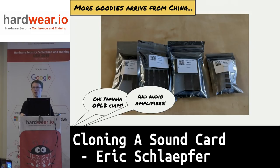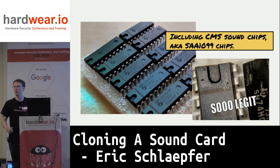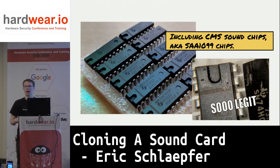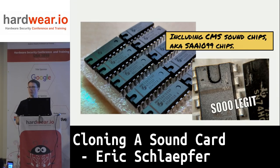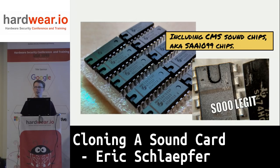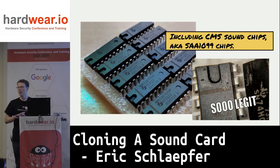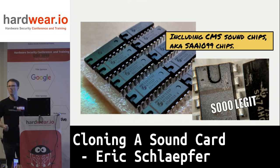Now that I have code, I can start ordering stuff from China, including some of the synthesizer chips — the SAA1099s — that the Sound Blaster uses to maintain compatibility with the Game Blaster. These chips are actually fake. You can see comparing them with 74-Series logic: if you scratch a real chip with a knife it turns white because of glass fibers in the packaging. When you try that on a fake chip that's had its part number scraped off and replaced with paint that's been laser-marked, the paint will kind of peel up. But these chips actually worked fine — they appear to be legitimate SAA1099s that have been remarketed to freshen up the date code.